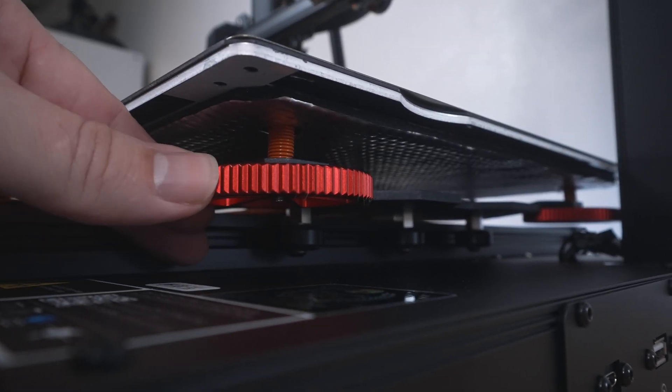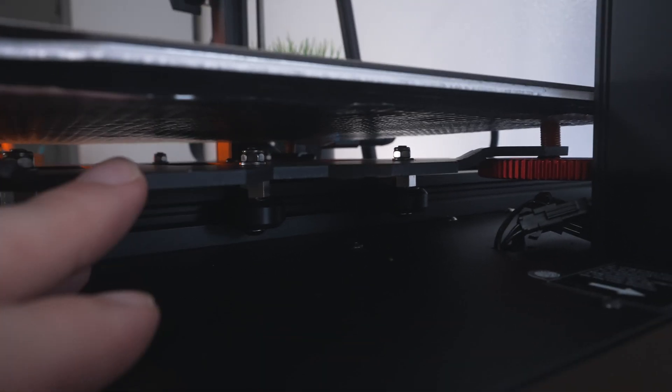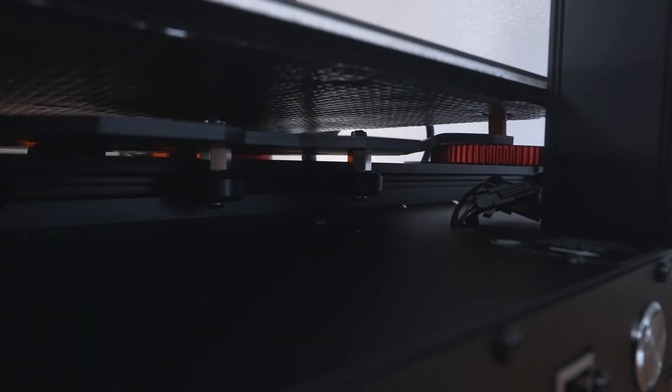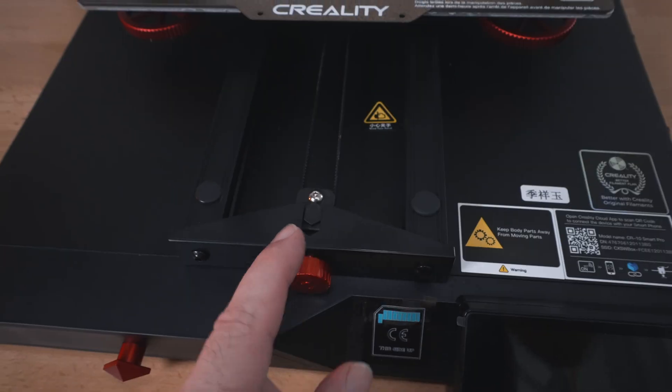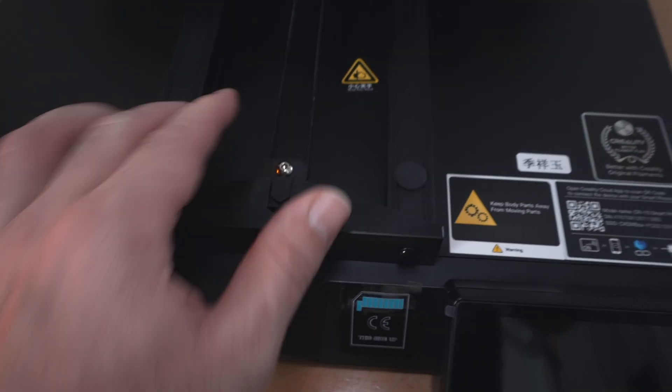For this size we have nice quality orange springs and aluminum, with very large adjustable knobs - very nice high quality everything here. The bed frame is also very thick and quite unique looking, with rollers on adjustable eccentric nuts. The bed rolls along two smaller channels, and this is where you adjust the Y belt.